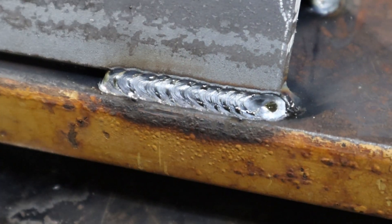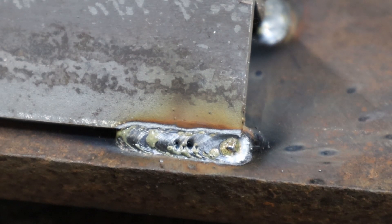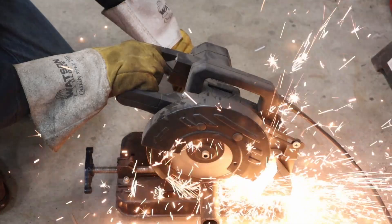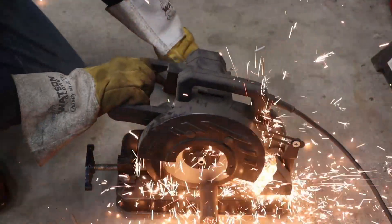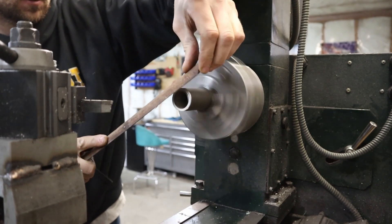When you grind the rust, and when you don't grind the rust — you'll see the difference. Now I have both a big and a little chop saw, but I always go to this little one because it just runs off of 7-inch zip cuts, which are way thinner than the big chop saw blades. Those big chop saws are just aggressive.